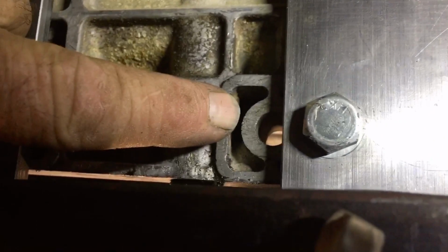So anyway, I've got this thing clamped, and I measured, not off my mount, but off that tab right there on each side, and I measured to the edge of this bar to get it exactly square with the transmission. Took me a little bit of doing, I'll have to say, but then I also measured off of this side, outside the bar, to this hole right here, that hole, and I got about 12 inches center, and I got them the same. A little bit ago I was a 16th off, and I wasn't happy with that, so I got it dead on.